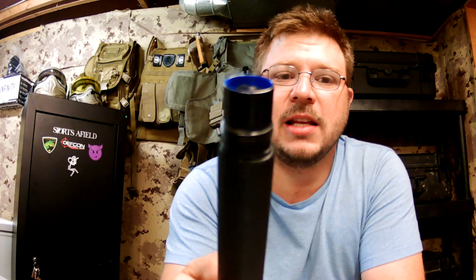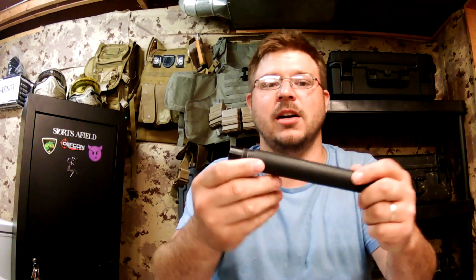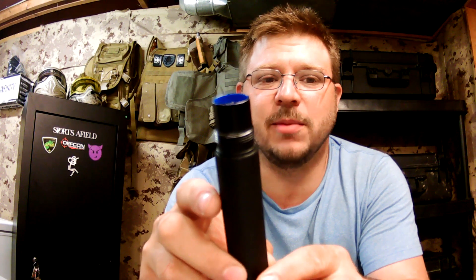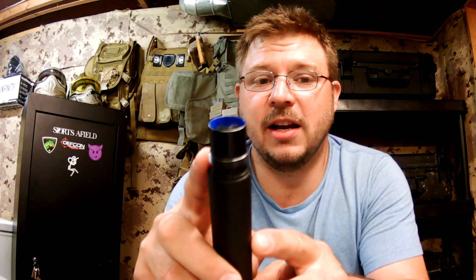We find out if my brass bushing is actually going to be doing its job. To do that, I've gone ahead and marked the inside of a barrel with my wife's nail polish, and it is on there super thick. So I am expecting some sort of contact, and if everything is lined up, what we're going to see is the bolt just chip off the thick parts of the paint.